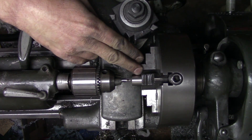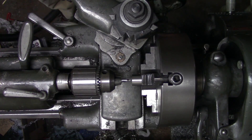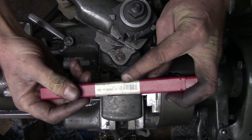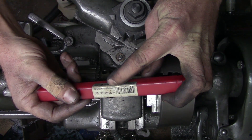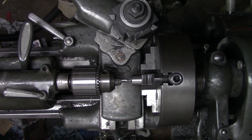We've got our sleeve and the four-jaw centered up. Now we're going to drill and ream it to accept those bushings. The outside diameter of those bushings is a half inch, and we're going to ream it with a half inch — or a thousandth undersized reamer — that way we can get a good press fit.